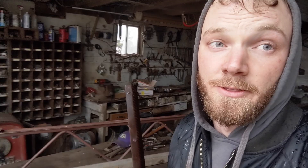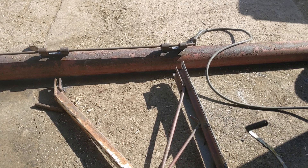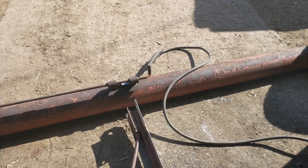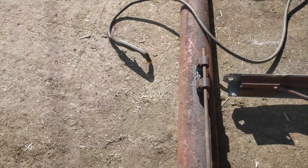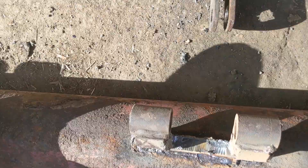Today I'm welding the hinges on the posts that we'll put down by the river. I went and got some measurements. We're gonna try to get the post about two and a half to three feet in the ground and then be about another two feet out of the ground, and then go up higher and put a cable from the top out to there. We had these hinges from an old spring tooth or something, so I cut them out and then cut slots in the post. I'm setting these in there and we'll get a good strong weld. I've butt welded hinges before but it's hard to get them strong, and this is gonna have some pretty good torque on it. Not bad for a farmer with an old stick welder — I think she'll hold.